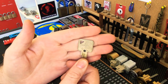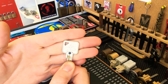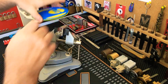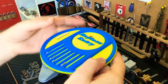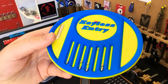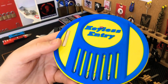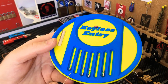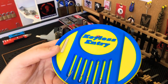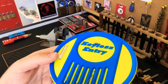This one is the euro spec MP10 multi-pin security lock. When gutting it, it had a wafer in each chamber. The key pins had a master in positions one, three, four, and six, and on the top in the bible there was one in two and five.